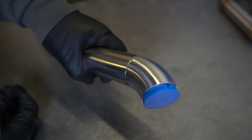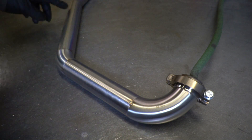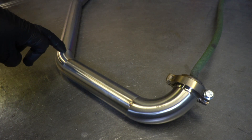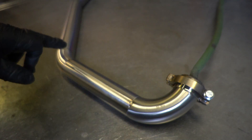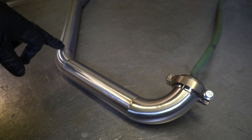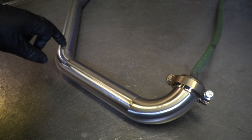We're going to evacuate the argon and get all the oxygen out of it. Now it's time to weld. On the thin wall part of this I'm going to be welding with .045 filler, making sure that I get full penetration on all the joints. Up here on the flange I'm going to use 1/16 308. If you're not 100% sure you're getting full penetration on these welds, it's a good idea to take some practice material, tack it together, weld it, and double check before you start building the dump tubes.